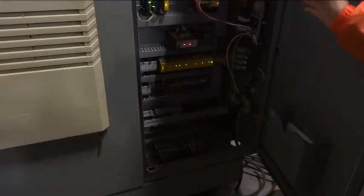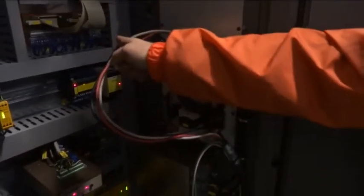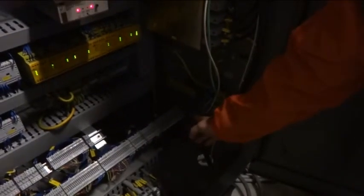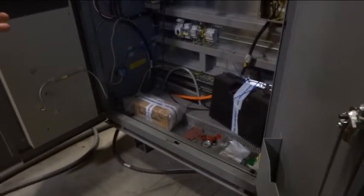Every machine here that needs neutral, that's X0, supplied from the transformer. They're 400 volt here, what you put on there, and we see this here. We did here in the warehouse L1, L2, L3, 400 volt from your transformer. Then the blue one is the neutral. We need neutral on the machine, and then we have the ground. The ground we have connected here, and you can also connect the machine to the floor if you want, putting a rod in the floor like some customers do. Also the chiller unit here, you can put a rod down there, 3 feet or whatever you like. Some people do it, some people don't.